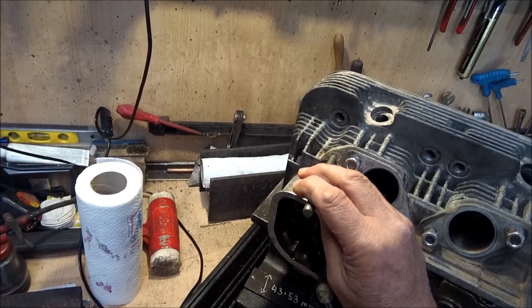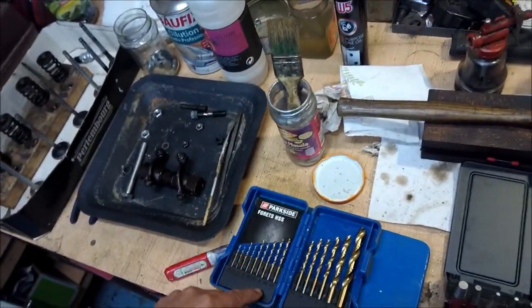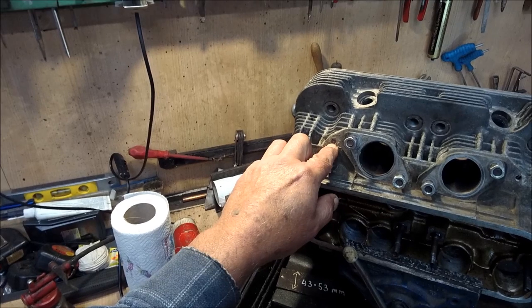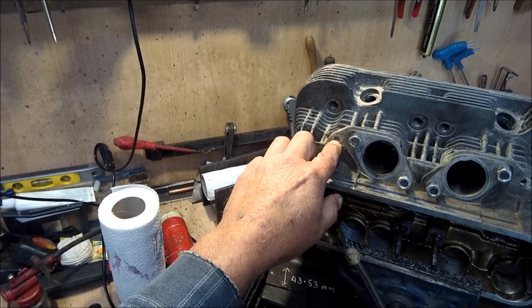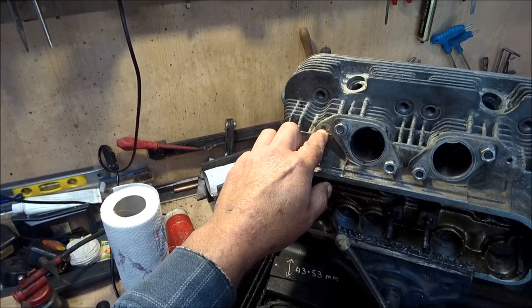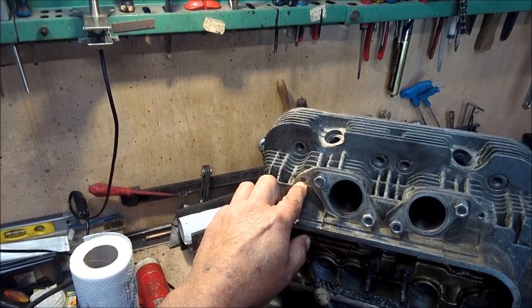What you have to do is start off by making a punch like that - I've already done it as you can see. Then we're going to drill it out with a small diameter drill, say something like a 3 or 3.5mm, just to get it started. We put a little bit of oil in, then we're going to go up to say 4.5 millimeter. Then we're going to either have to tap it out, or we might be able to collapse the threads - there's never two quite the same.